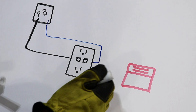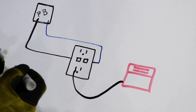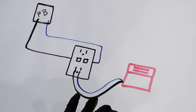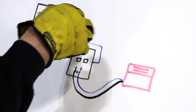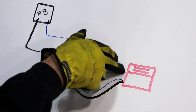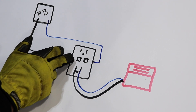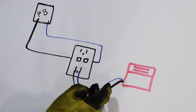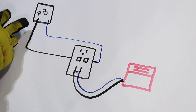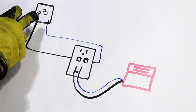To complete our circuit, let's say we want to make some toast. We have our toaster here — even though this is one wire, I'm just going to draw the individual wires. So now we have our toaster plugged into our GFCI outlet, but still the circuit isn't complete — we haven't put the bread in and pushed the button down. There's no current flowing through the circuit yet. But then we get our bread, put it in the toaster, and push the button down. Now the toaster begins to work, and current flows from the panel box through the hot wire, back through the neutral wire, and back to the panel box. Before we hit the button, all we had was voltage — a potential for current to flow. Once we push the button, now we actually have current.